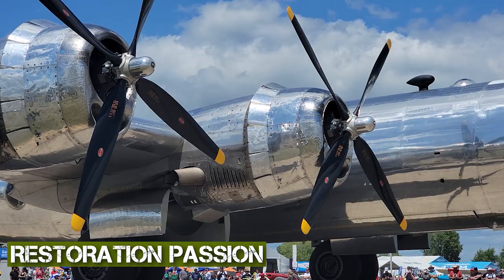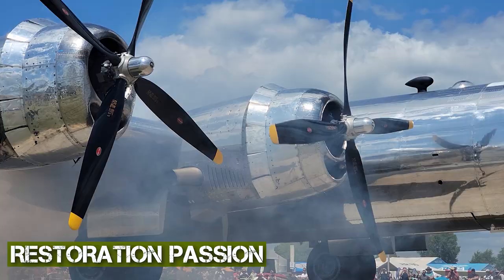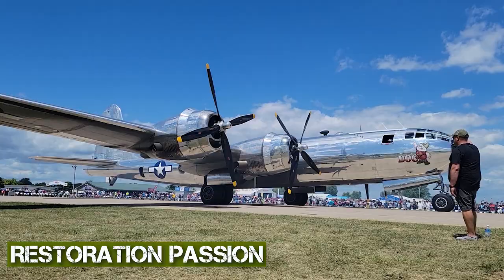Okay, so we're going to start number 3. We'll start 3, 4, and then 2, 1. And what we're going to do here, how this works, is open the throttle. You need to crack open enough to get enough air to start it. Too much air, it backfires as it leans out.